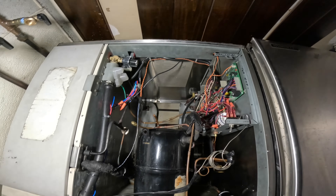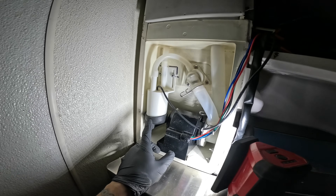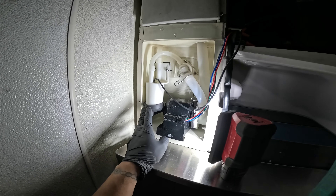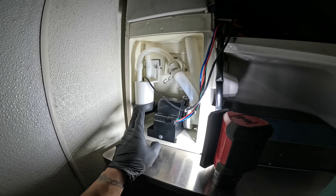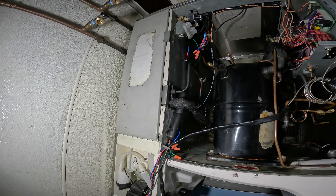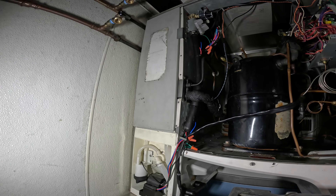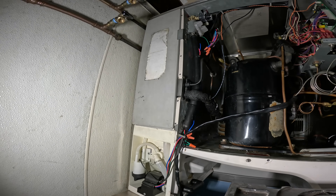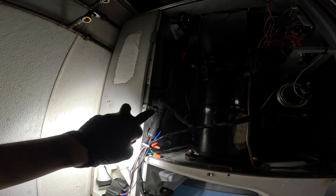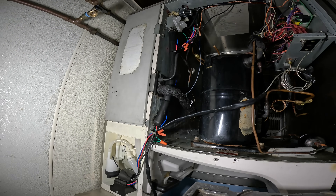All right, we got this ice machine filled to the ceiling, so we're here to change the float switch. What happened here was pretty interesting — a little tricky, but it makes sense once you look at the symptoms. Once we fixed the leak, the evaporator coil was getting frozen, which we want. It wasn't doing that before because we lost about half the charge. We could physically see ice being produced inside, it just wasn't dropping.